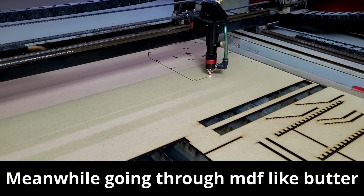For the plates, I used to use MDF and acrylic. But since the new design has 5 more cylinders, acrylic won't cut it anymore, so I upgraded it to 5mm polycarbonate. If you never used polycarbonate before, don't try to laser cut it like me, it was a nightmare, it was horrible. It doesn't really cut, it just burns and creates nightmarish toxic fumes. Just use a CNC router.